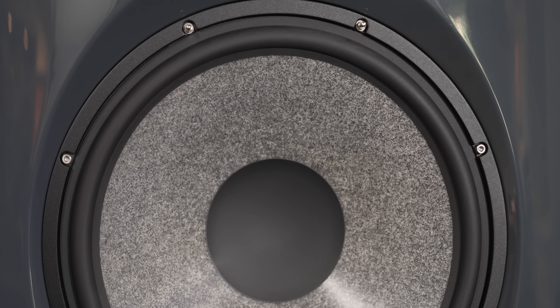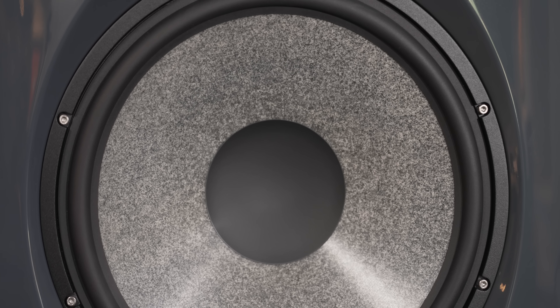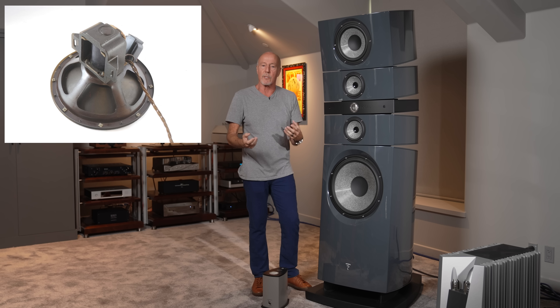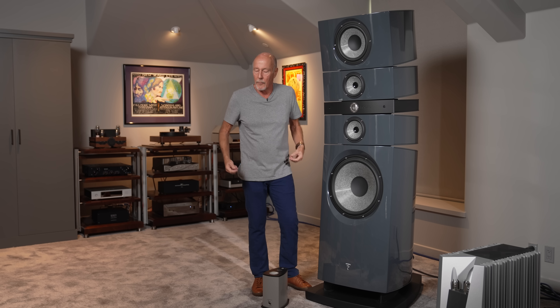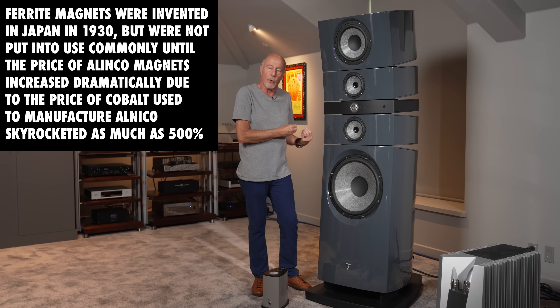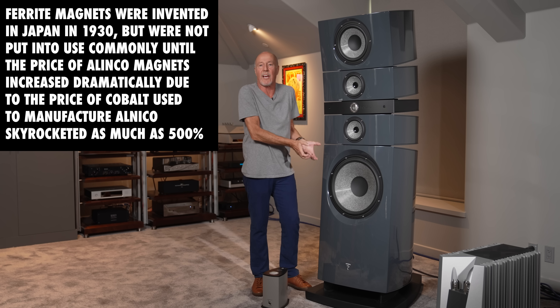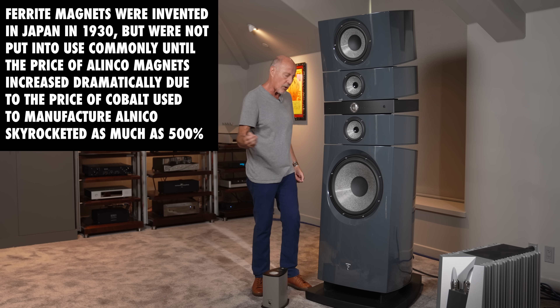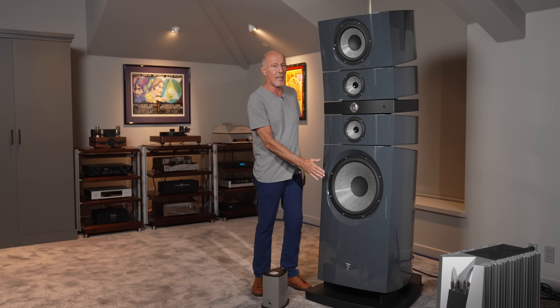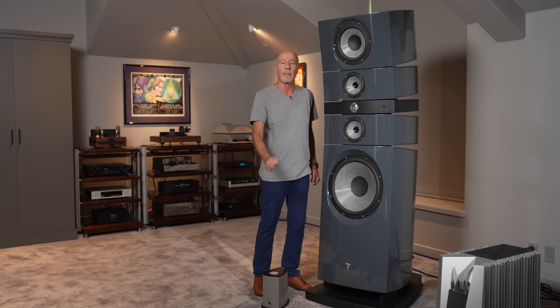Why would they do that? Back in the early days of loudspeakers, that's pretty much what everybody used. Even if you had a Philco tabletop radio, most of them were using field coil speakers because magnet technology had not really caught up to audio back then. You didn't have ferrite magnets, you didn't have Alnico — that stuff didn't exist. You had to plug into the wall to get enough efficiency out of the speaker, and you didn't have very high power amplifiers either. So why are they using old technology to address new problems? Because nobody really does this anymore — they don't do it because it's expensive and it's difficult.